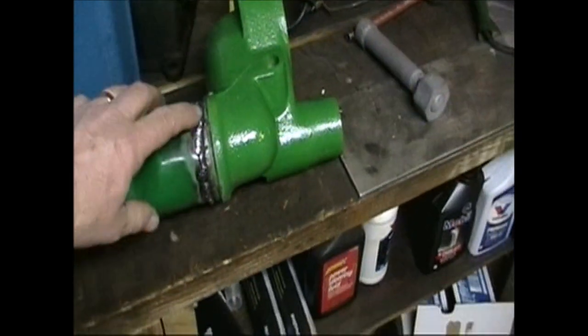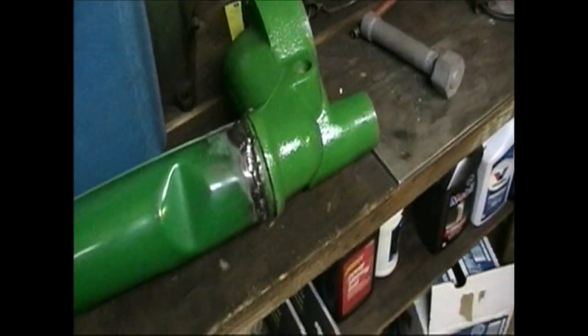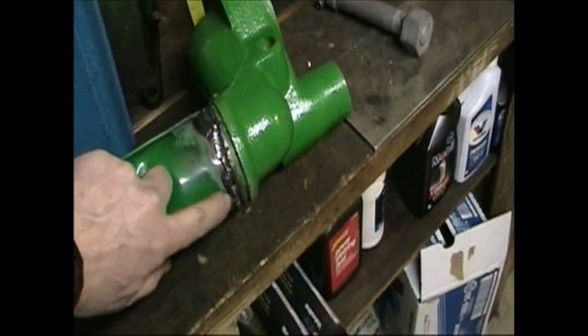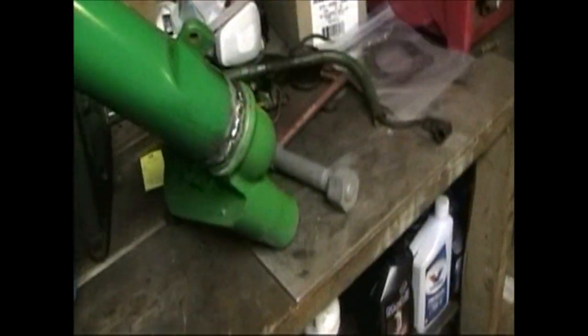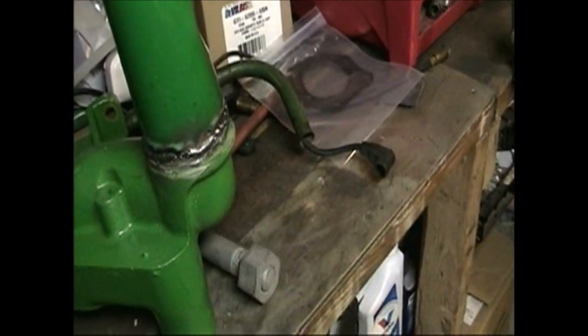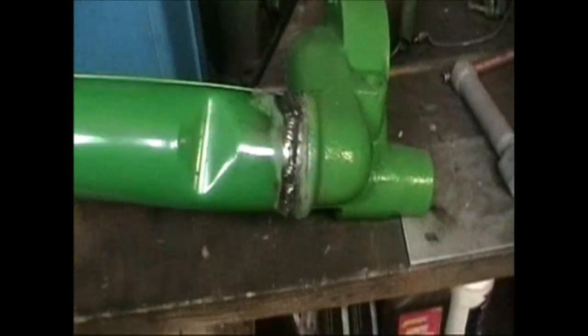And they continuously welded these in place. And I'll show you the one down cellar that came off. It was broken. So I had to chisel off the old one and then weld the new one in place. I'd never welded sheet metal to a casting before, so that was kind of an interesting process, but it looks like it all worked. And we'll get a coat of paint on it. It'll work better than the original.